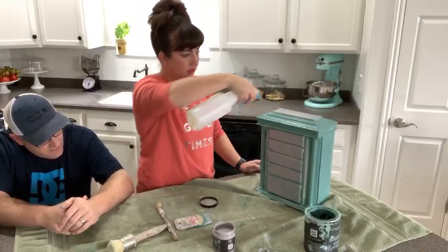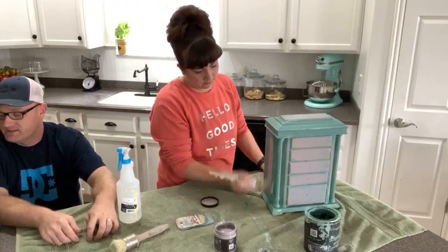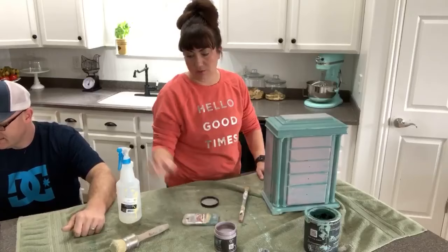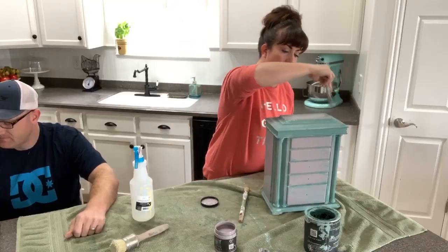It's going to look like a mess for a little bit - most blended finishes do. When you start layering back in again that's when they get better - it has to get bad before it gets good. The thing with blending is you don't want to push too hard because then you get through the paint to the base coat, especially on this piece which is MDF and super shiny.